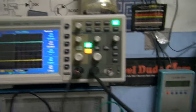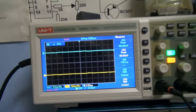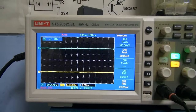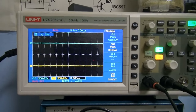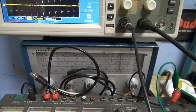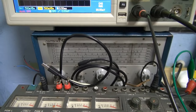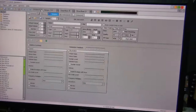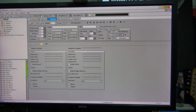One transformer is hooked up to the oscilloscope. The blue trace on the scope is measuring what's going into the transformer, and the yellow trace is measuring what's coming out. There's no function generator available — only an RF one which won't be useful here — but Open ModPlug Tracker with OPL synthesis can produce a pure sine wave output. A computer isn't the best function generator, but it'll have to do.